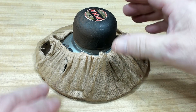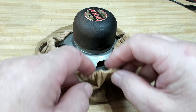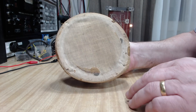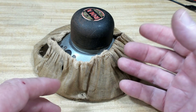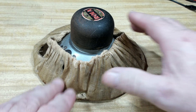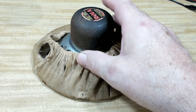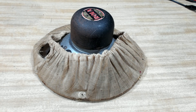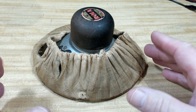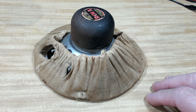I was just about to remount this speaker on its backboard and I started to wonder about this cloth. It's not in bad condition, but some of the stitching is coming apart, someone's put holes in it, and it's got glue on it. The cloth is there to stop boominess at very low levels where it tends to over-vibrate — Phillips thought this was a good way of fixing it. It may also act as a dust cloth, but I believe it was actually an acoustic cloth. I found a book on the internet that explains why they use these cloths — I'll leave a link in the description. I think I'll make a new one, and if the owner wants the old one put back in, we can do that.